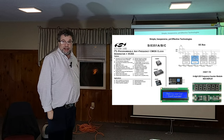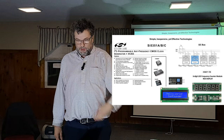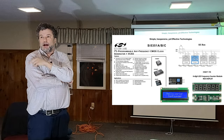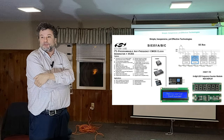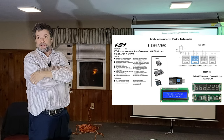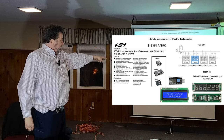Those of you who build receivers - if you have two things that are exactly 90 degrees out of phase, you're starting to build reasonably complex receivers. And then there's the I2C bus. One of the things you'll find with homebrewing is you get this spaghetti of wires - 20 wires into this and 30 wires into that. I2C is a very nice bus: three wires, a data line, a clock line, and a power line. It's also multi-drop - you can have any number of devices on the bus and they're tri-state.